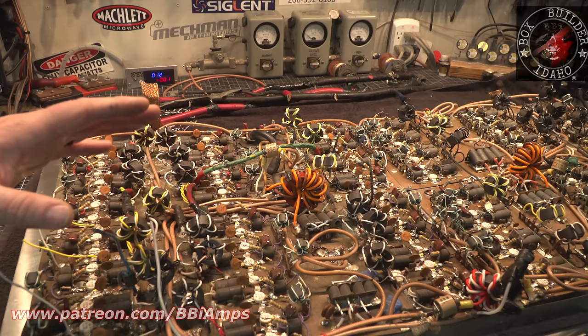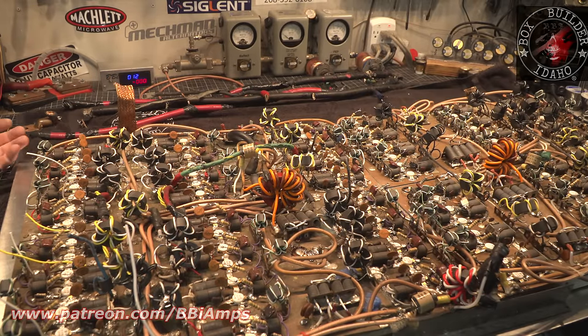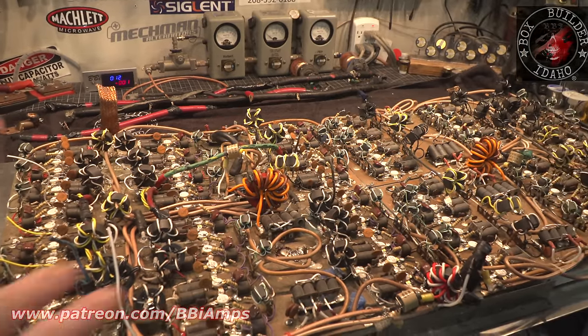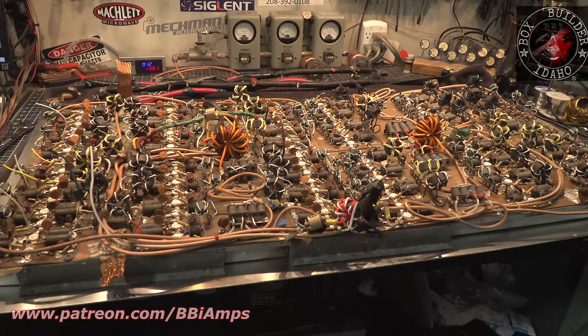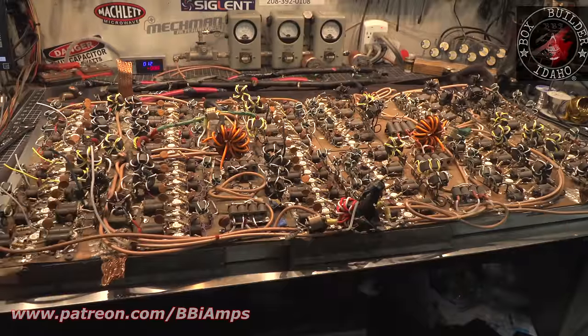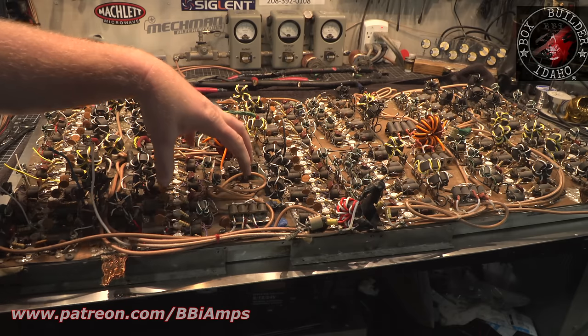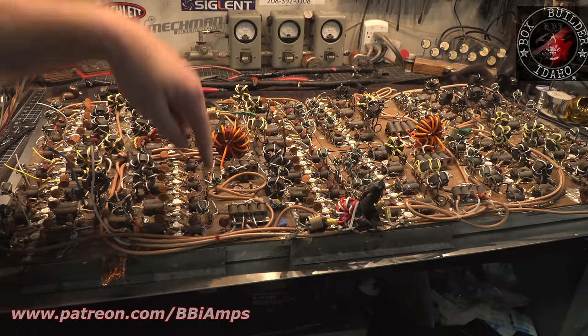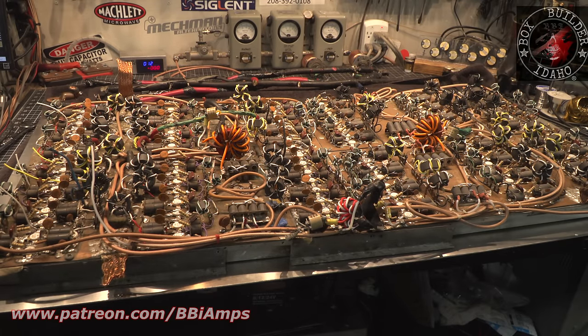Now, to add insult to injury, they made the cabinet literally that much bigger than the heat sink. So we have grown out about an inch and a half on each side and almost a full 2 inches on each end, which gives us room to work. We're gonna capitalize on that as well. There's gonna be some other trick done with a solid copper bus that's gonna go down through here and help us carry more ground current to each pallet, each heatsink. Believe me, if there are enough screws in the phenolic up here bolting to the heatsink underneath, the metal mass of the heatsink will carry way more current than any wire, from all aspects: surface area, current flow, heat saturation.